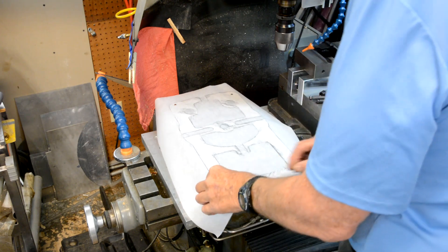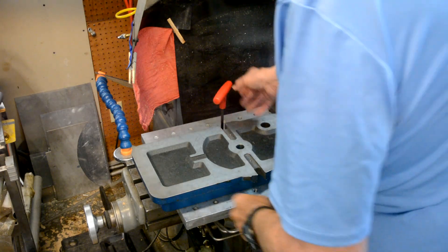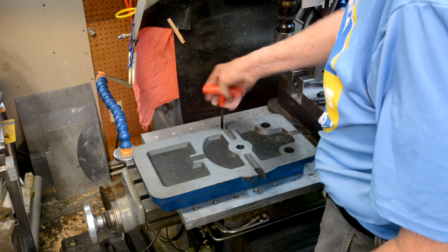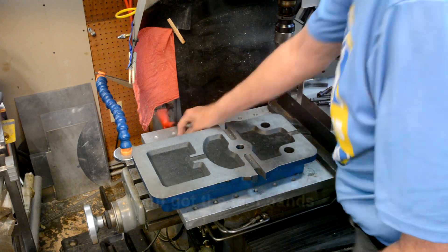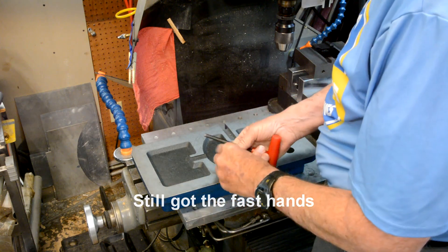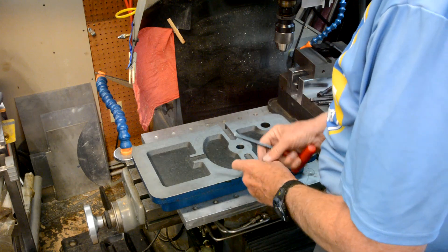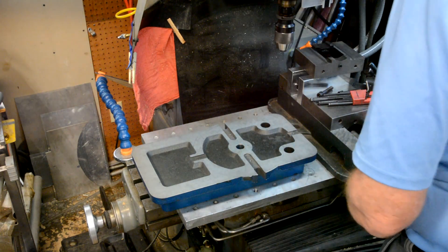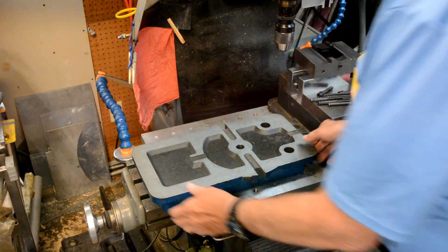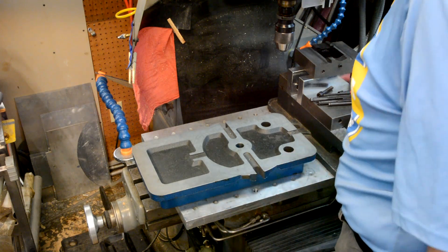Take these magnets off. On this plate I made, I put a hole every two inches — half-inch holes — and then got these half-inch threaded plugs, so anywhere I need to hook or bolt something down I just pull out the plug. Something I did years ago; I have a video showing me drilling these holes in this plate.